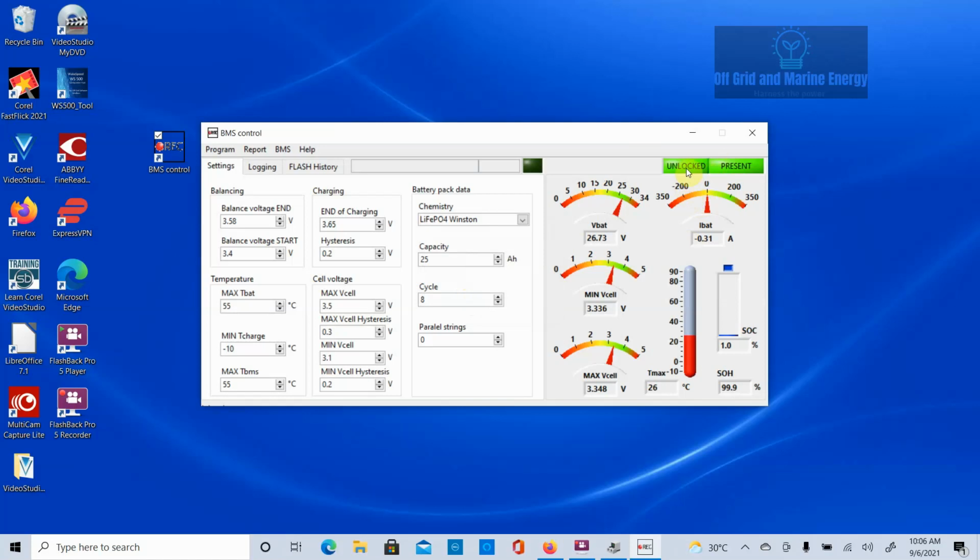Let's go through that again. Maybe I can do it this time without using the wrong words. So I clicked it to lock it again, click on it, we type in 1, because it's a Q series, we type in the Q, we ignore the first negative sign there, or dash. Then we add dash and then the serial number. If by chance you enter it incorrectly, it will just sit there and wait until you get it right. Now we are in an unlocked condition.